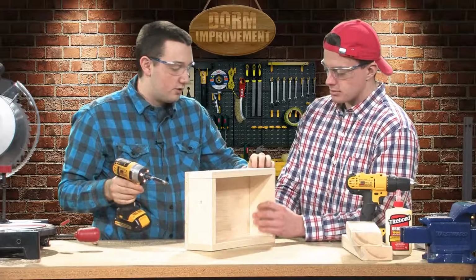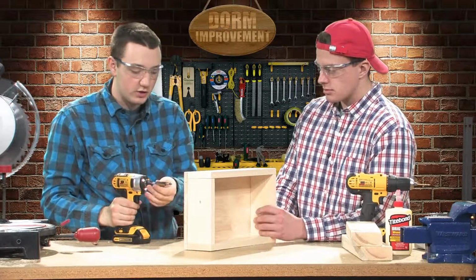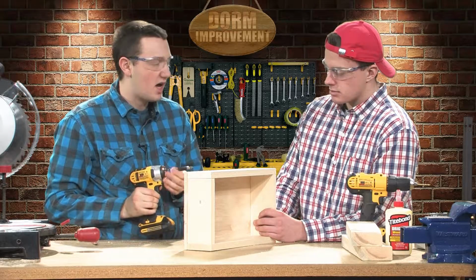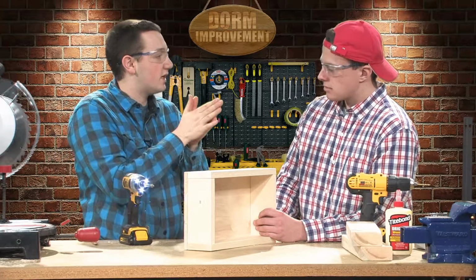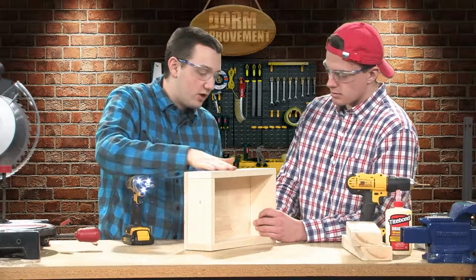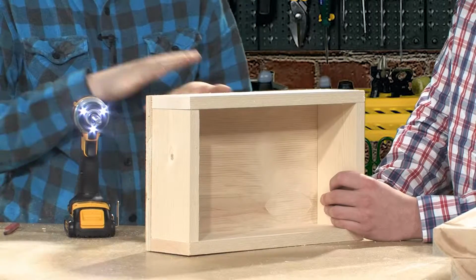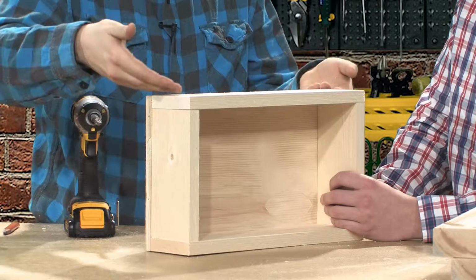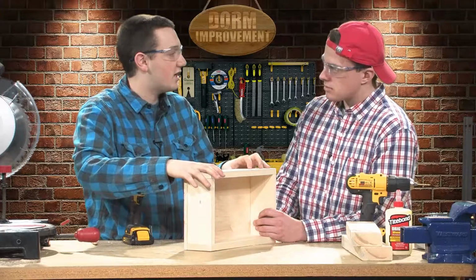of, there's different depths of putting screws in, and you can actually buy certain depth stoppers. So there's a depth stopper for drywall because you want the screw to sink into the drywall a little bit. We want these screws to be pretty much flush with the face of the wood, or maybe sunk in just a very little bit. You don't want to over drill it, because the more you over drill it, the less surface that it's actually holding.